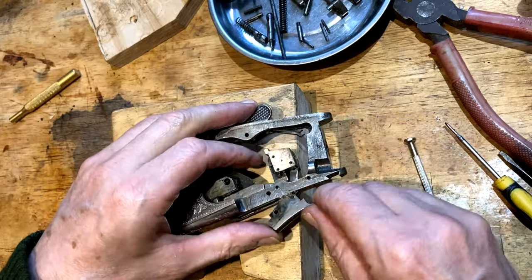Okay, so that's the cam operating. That's it out of engagement there. And then push that back, and you will need a bit of a tap. Now, I will generally use a piece of brass, but you must pull that back first. On this one, it seems retained. Usually they draw straight out, but or certainly they have in the past. So you just tap it out.